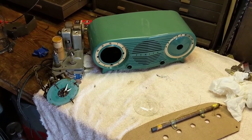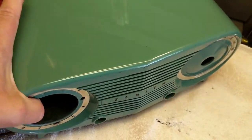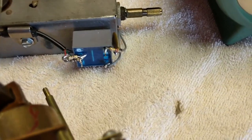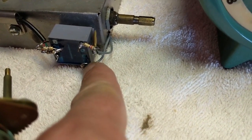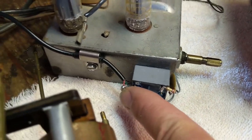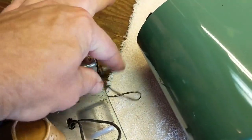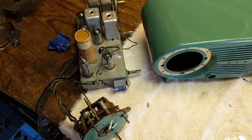Hello — it works! I've returned from the museum and got my back and ferrite rod antenna installed. I also did a few more passes on the case with the wax and it's looking pretty darn snazzy. I cleaned the clock dial cover and also installed the audio input. The way these work is that your primary of your isolation transformer goes to either end of the volume pot, and then you tie your right and left channels together with a set of resistors so you have mono. I put a cord keeper on there so you can't yank it out, and there's a switch off the IF can for the radio signal so you can turn it on and off — that way when your audio goes through, you won't get the radio interfering.